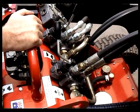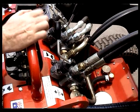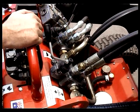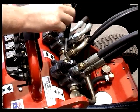The auxiliary lever has three positions. The neutral or central position allows no oil flow to the attachment. This is also the position required when starting the Dingo. Pulling the lever back engages the attachment. Pushing this lever forward reverses the oil and so reverses the attachment.